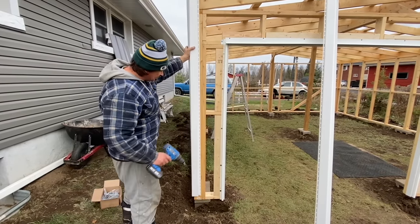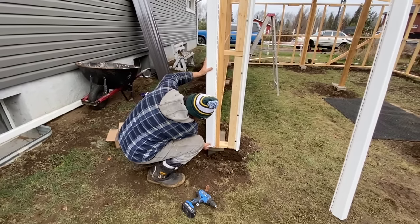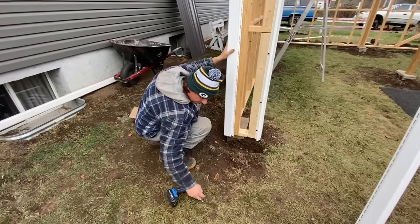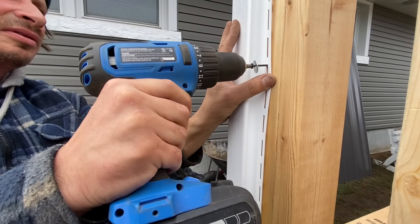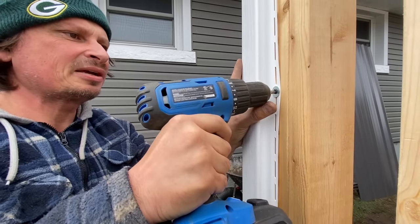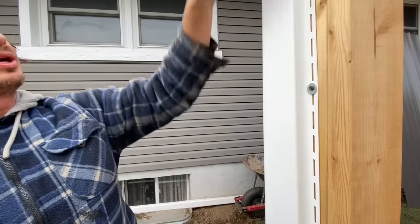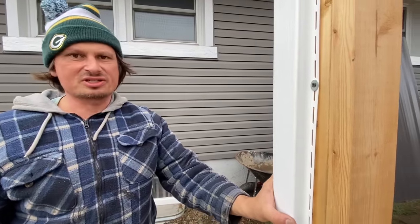You just put this on like so. Making it just go a tiny little bit past the wood, just like that. Drywall screw with a washer, guys. Okay, and same thing, you gotta bring it back. It has to move, otherwise when it's hot or cold, it's gonna work. Okay, I'm gonna go ahead and put them probably about a foot apart from each other, attach this whole thing.